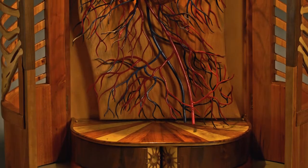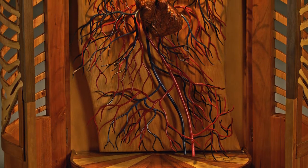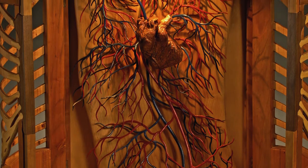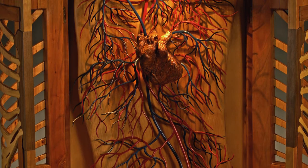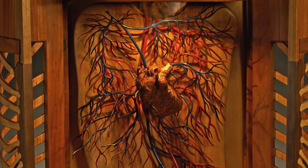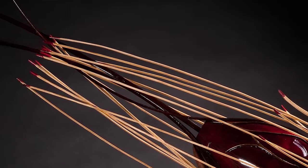And eventually I thought, well, if I make it into plywood first, then I know what to do with plywood. I know how to use it. And so for 10 years, I was making homemade plywood with varying degrees of success. And then in 2001, rather than try to clamp it the way I'd been trying, I put it into a vacuum bag, and out popped this new material, which I haven't got any hard proof yet, but I'm pretty sure is plasticized wood. And the epoxy is the adhesive of choice. I've been working with epoxy since sometime in the 80s. So the epoxy, I'm assuming, is infusing the cellular structure of the veneer, which is thin enough to allow it to do that, and it's setting up inside the wood and creating a plasticized wood.